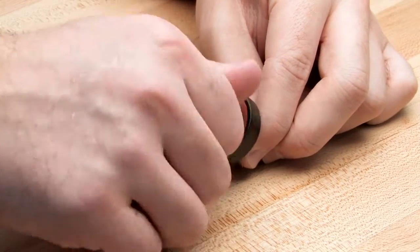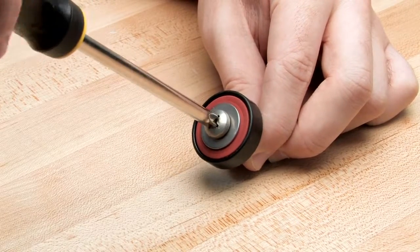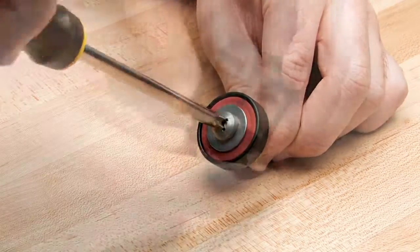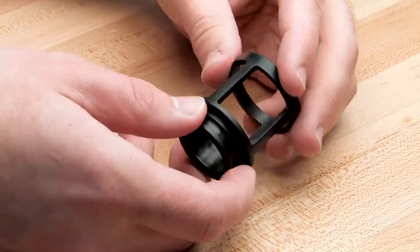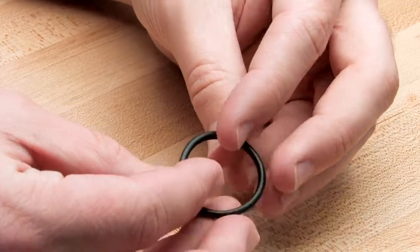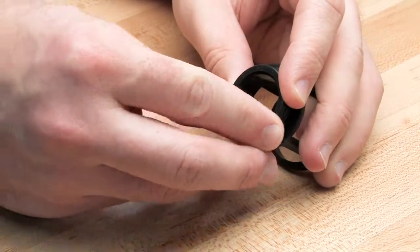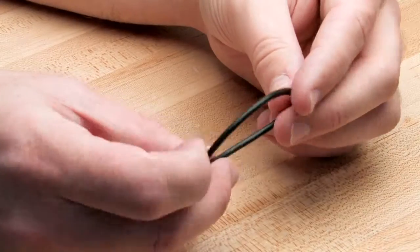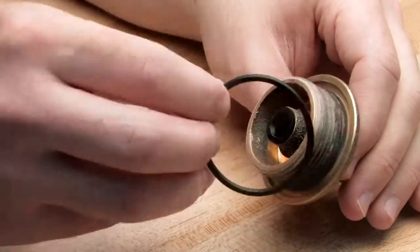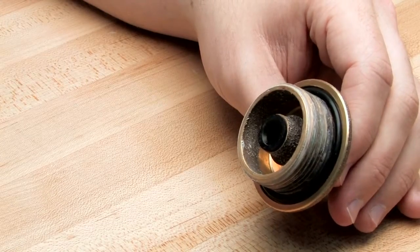Reinstall the washer and reconnect the assembly with the screw. Likewise, inspect the seat and seat O-ring. Replace if necessary. Reinstall the O-ring around the base of the seat. Finish by inspecting the cover O-ring and reinstalling it around the cover. After your inspection, lubricate both the cover and seat O-rings before reinstallation.